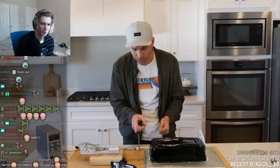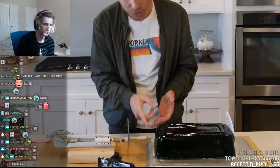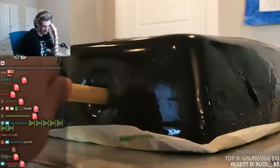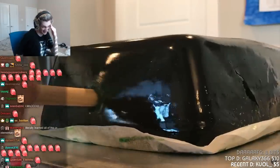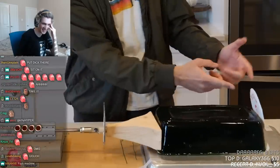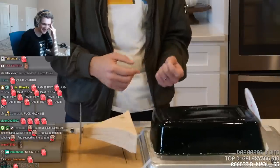So without the curvy horn portion, as the diaphragm moves back and forth, it interfaces with the air sort of like this. You can still see the jello moving on the opposite side, just not that much, because the air is just too thin and weak over this small of an area. So to have a better interface with the air, you put a big curvy shape right after the diaphragm. You can see now your eardrum is moving back and forth much more vigorously because the interface is so much better.